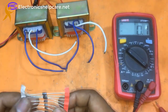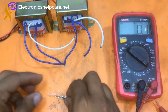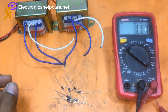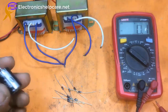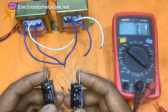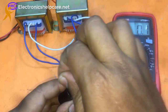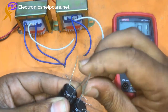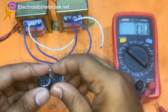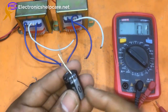I am using four diodes for the low voltage and another four diodes for the high voltage. For the capacitors, I am using 35-volt rated ones — if you use 50-volt capacitors that will be better. This is the negative side and this positive side will be joined together. This connection is for ground.